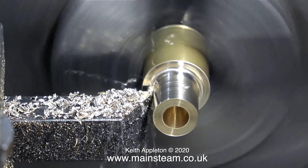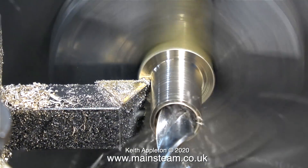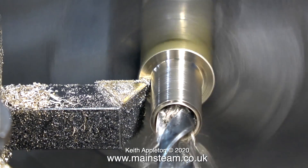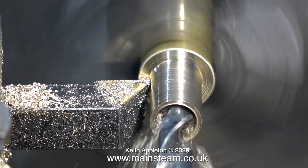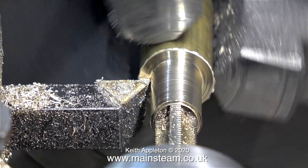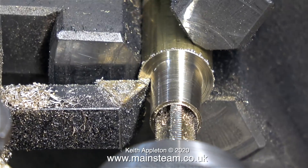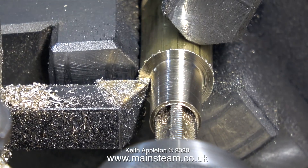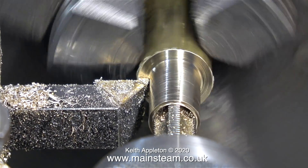There's already a hole in the end of this piece of brass — it's not 100% but it's near enough for this component that I'm going to make, which is just a threaded sleeve. Now I'm drilling the part to tapping size for 5/16 by 32 threads per inch, and as you can see the wall of the adapter is very thin. This is not a highly stressed component, but normally I would not thread a piece of 3/8 bar 5/16 by 32 down the center.